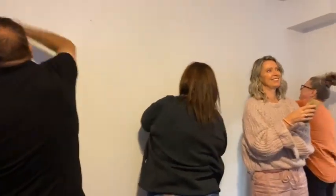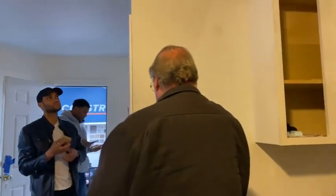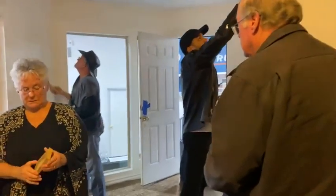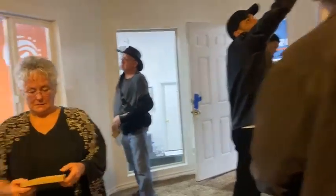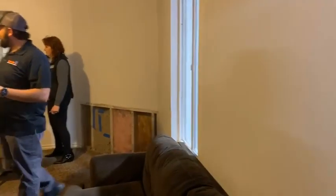Yeah. Right? This is the first process. The first process is wiping down any of the big debris that's stuck to the walls. So we'll have guys in the job site with these chem sponges or dry sponges wiping down walls. Now you wipe down the wall until you get no more transfer of soot on the dry sponge. So if you can imagine how long they're sitting there wiping, right? So that's the first step, is wiping down with the dry sponge.